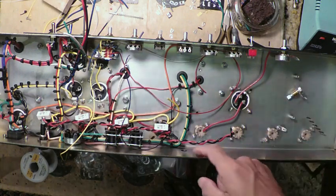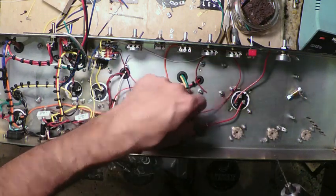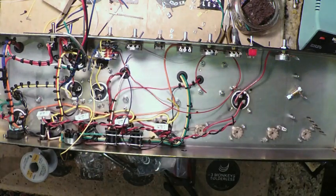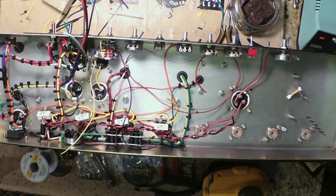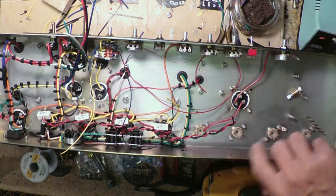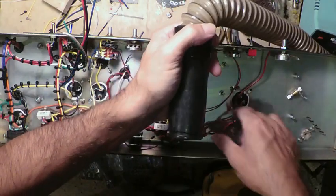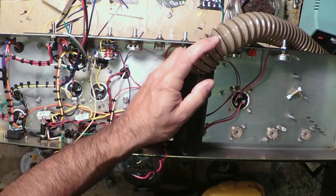All right, so now this 25K is going on the back, so we need to chase out the hole that we originally put in through the Plexi, right? So I'm going to start a pilot hole through there. Then I'm going to grab my unibit and chase it out to get the Plexi cut exactly to the hole. I'm going to use the vacuum at the same time. I like to use the vacuum this way. I'll put it right here and then drill through, and the vacuum will suck up all the plastic, so I won't have to vacuum it up again. So here we go.